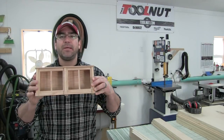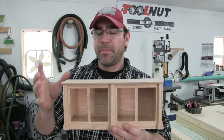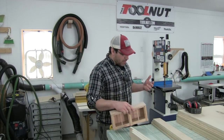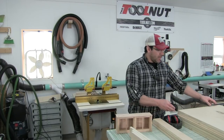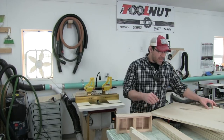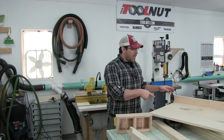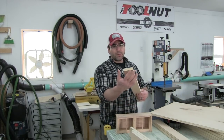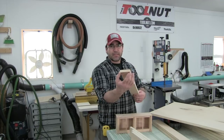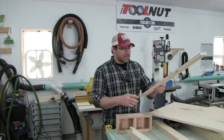On this TV console, this outside edge, the middle, and this outside edge are being made as separate individual pieces — I'm calling them columns. The way I'm going to make those is by making a rabbet along the back so that a piece will fit in along the back edge of the column. On the front edge, I'm going to cut 45 degrees, so I'll have 45-degree cuts on both sides. That way, when I put it together, it hides the plies of the plywood.